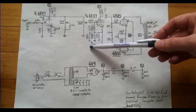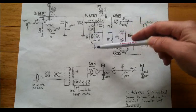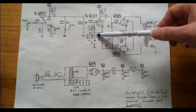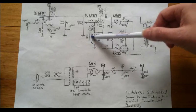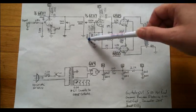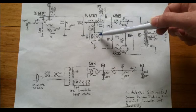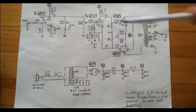Here is the switch that was added. What's happening is the 100K is the clean setting. If you switch over to 47K, that's what I'm calling the normal. This 1.5K is creating that overdrive. You could also put a pot in this position — something like a 100K — which would go from 100K all the way down to zero. Or you could put a series resistor into a 100K pot so that you'd have a minimum of 1.5K and then 100K above that.